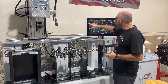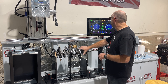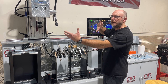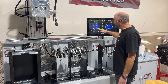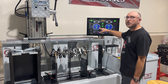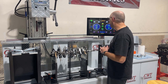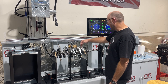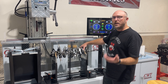So I'm going to click 'first spin' here, and then what I'm going to do is rotate this around until I find out where it is in terms of coupling. By coupling, I mean how close the impulse is out of balance on this side versus that side. Remember, our counterweights should be opposing each other exactly 180 degrees out — we have a little bit of tolerance there. If I can be between about 150 and 200 degrees, I'm looking pretty good. Right now I'm at TDC on this side, and I'm at 188 degrees — which is only eight degrees out of perfect coupling. But it's going to need some grams.